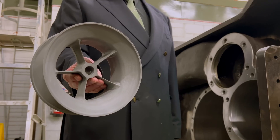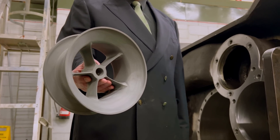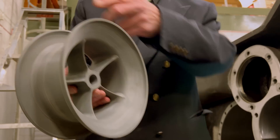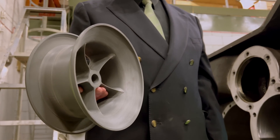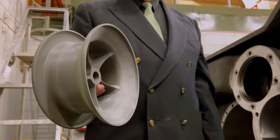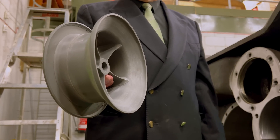This is a full-sized, 3D-printed model of an inlet valve. It's what is known as a double-beat valve, so there are actually two seats — one there and one here — which make contact with the seats inside the valve chamber to seal it when it's closed. In principle, this is like a car valve, but those are only single-seat or single-beat valves.